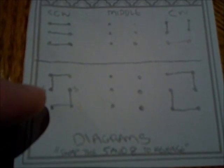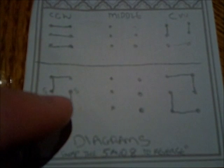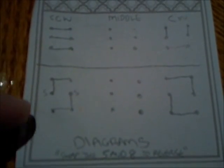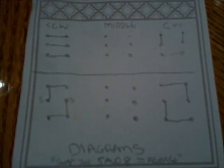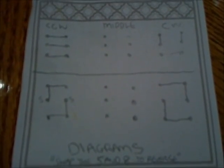This is more common, and you see this on one of the motors that was out there. I drew the S's in there. That's what I call the starter plug, but normally your hot goes in and your neutral goes in, and they'll pass through, but they'll reverse these two, and you see it's the exact opposite when it goes the other way, and that's reversing the starter motor to change the initial direction,